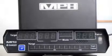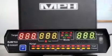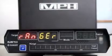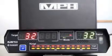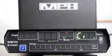Now, when you first turn the Ranger on, the only switch on the Ranger is the on and off switch. First turn it on, this is what you get. You press and release the power button on the readout unit. This causes the Ranger EZ to power up and perform a power on self-test. Radar lights up all of its display segments and then displays Ranger in its speed windows. You then perform a 32 mile per hour internal test, moving and stationary, and it will display pass in the middle window upon completion of the test if everything's okay.